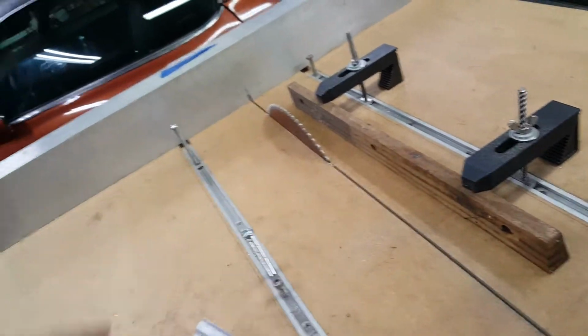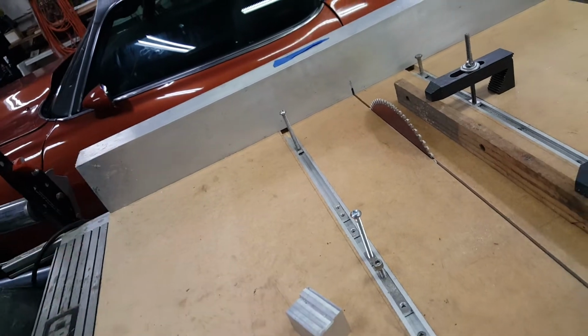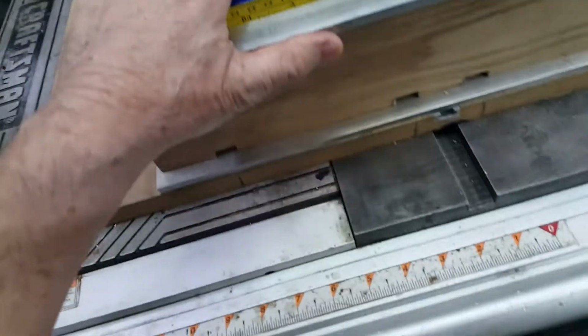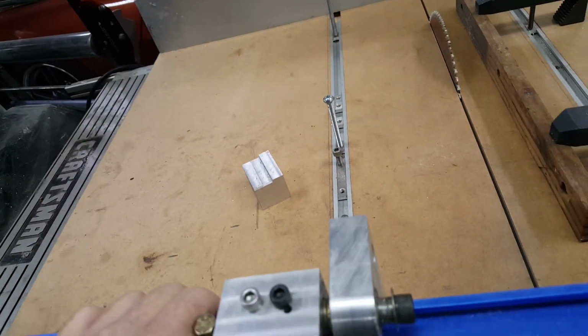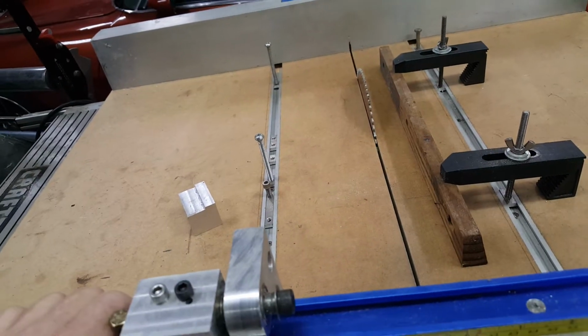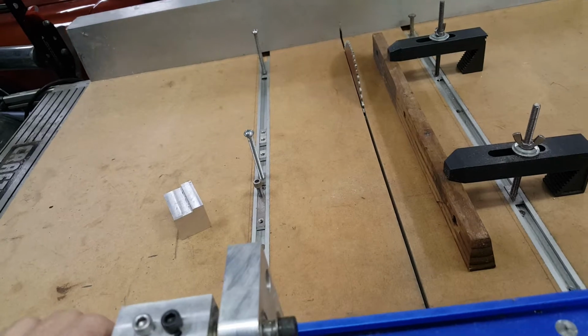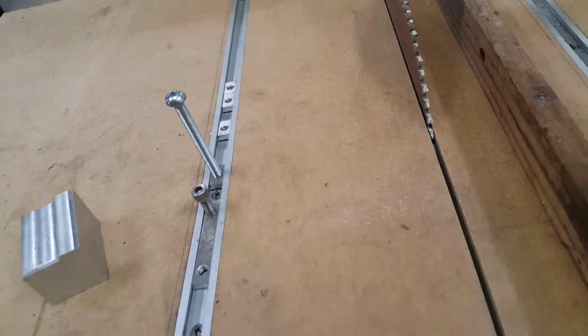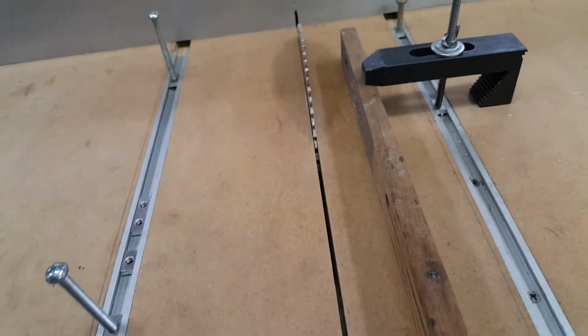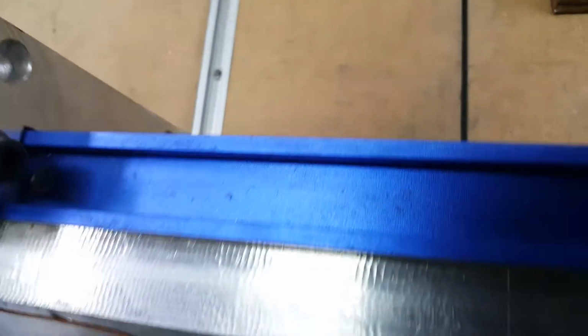And this guy right here, when I put this on here first to get it to slide in and out on the rails on the table saw, the blade was down deep into it. And then I raised the blade into it and cut that slot. And that slot is maybe about 5/1000ths wider on either side than the blade. So measuring from the slot to the edge of wherever I want to cut works well.